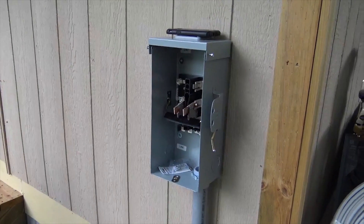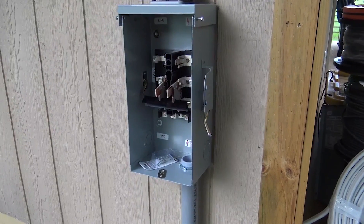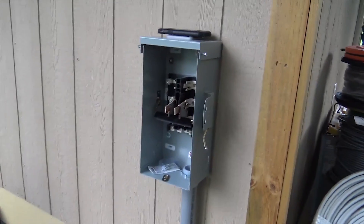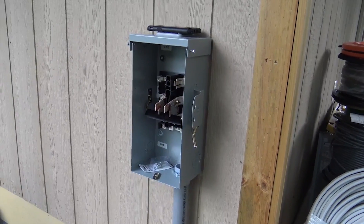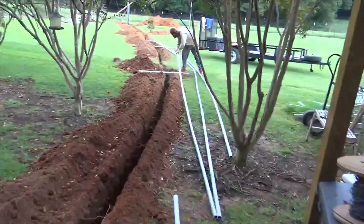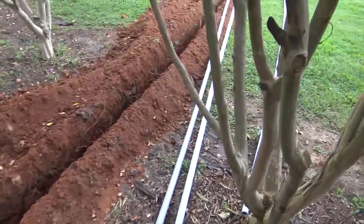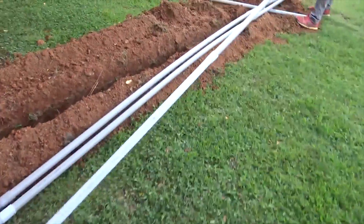They'll add a separate meter on the outbuilding, which was a surprise to me — very thankful I brought the transfer switch along. I was worried about the neutrals, but the power company confirmed both buildings are tapped on the same transformer, so we're okay there. We're feeding into a panel inside that has mini-splits, freezers, and refrigerators. Abraham is working like crazy running pipes — not only for this week's work but for future expansion, which could nearly triple the solar capability.